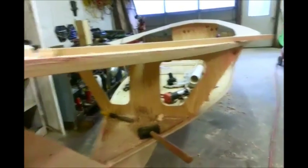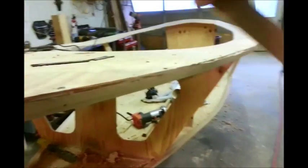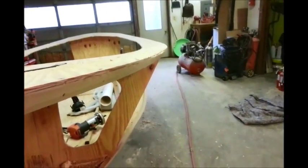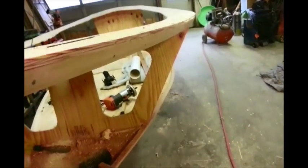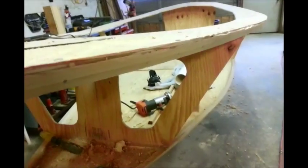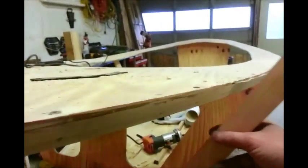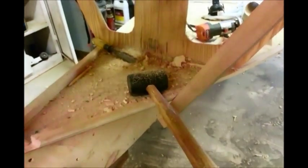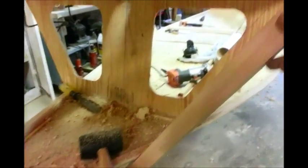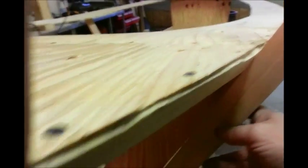So today's May 3rd, we're back at it. In the last segment we showed you how we were trimming the sides of the top deck and the bottom deck to get them flush with each other, so when we wrap it with plywood for the sides we'll get a nice fit. The way we're doing that is we're taking a stick and laying it across to make sure that on both the top and the bottom, the angle is such that we'll get a good glue joint.